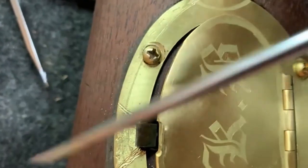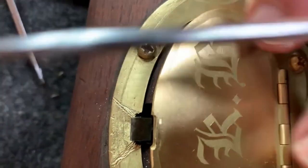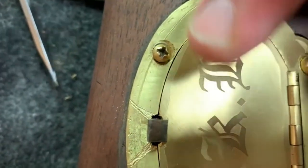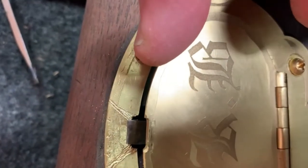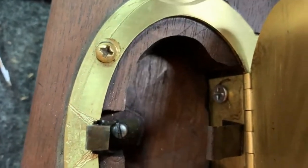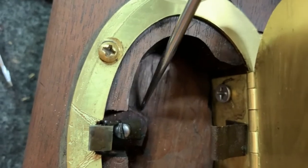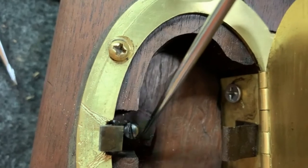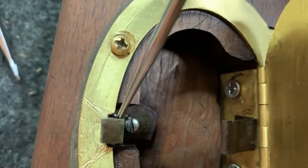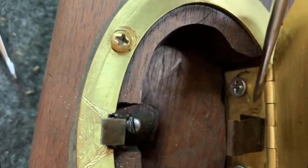So you need to router that depth in when making the notch for this latch. When we close the lid here, you can see what I mean about filing out the lid a little bit — not near as much as you have to file out the outer ring, but you've got to have room for that latch to work. And then when you pull on the latch, the spring in the back pops the lid up just enough to get your finger under there. You'll notice here how I mentioned that little pedestal that the latch spring's got to set on — it's got to be higher than the bottom of the trough, which is dictated by this lid plate back here.